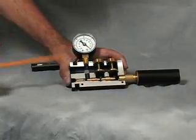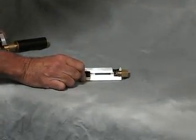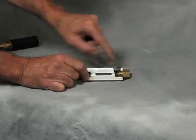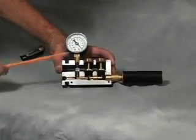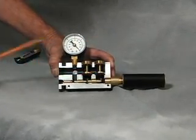In a lot of cases you can only get 10, 12, or 15 cubic feet of vacuum flow in a single venturi because of size restrictions. In a multi venturi, you can get 25 cubic feet of vacuum flow using the three-stage technology.